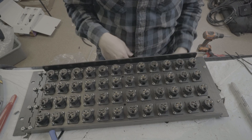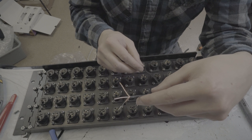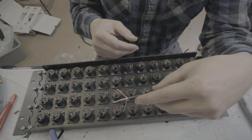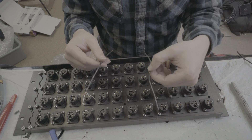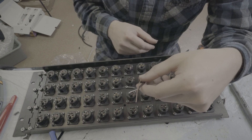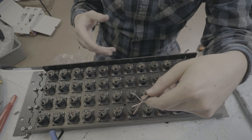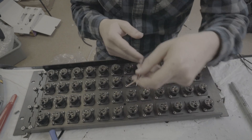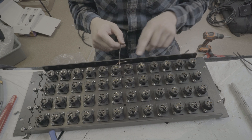We've got all of our connectors tinned and I made little tails. This is Mogami multi-core cable — a flexible multi-core cable — and each one is labeled, so there's one, two, and so forth, up to eight channels per multi-core. I cut a five-ish foot tail to get a three-ish foot finished tail because we need to find center. We actually decided to do nine inches left to right, which gets us from a center point on the panel so we can stretch our pieces left and right.